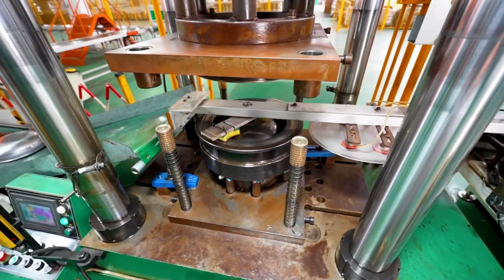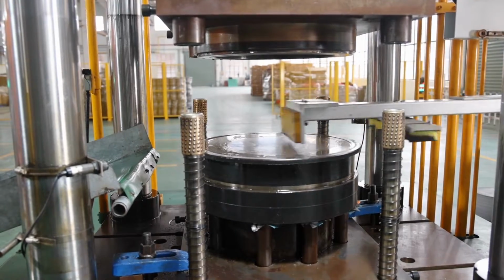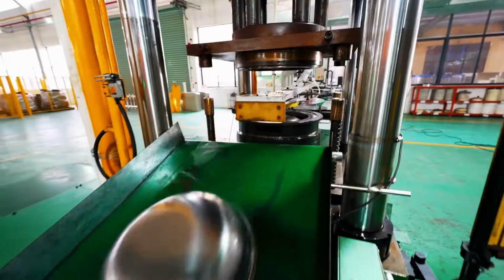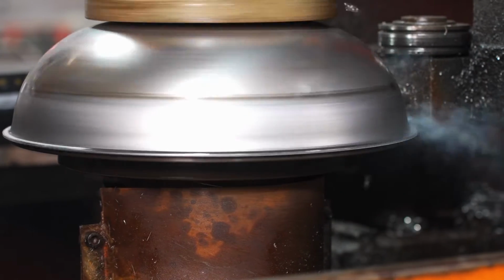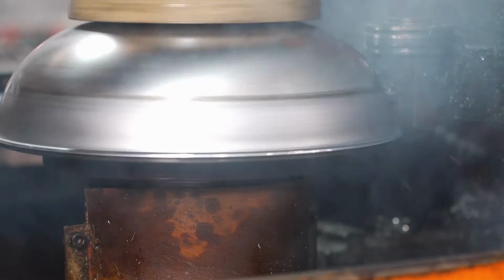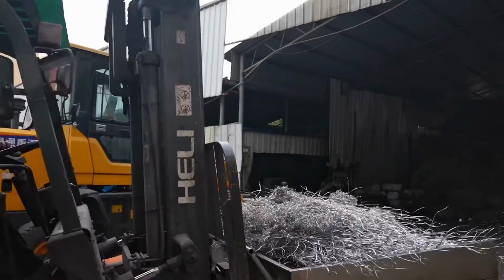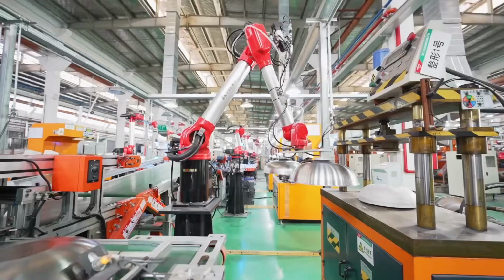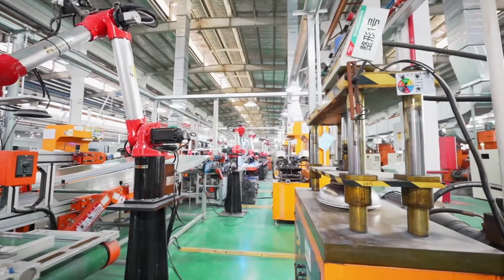Machinery now pulls the aluminum sheet forward to a 130-ton punch press. This powerful press forces the metal around a frying pan-shaped die, and then punches out the shape. The sides of the pan are very uneven now. The machine is now cutting the edge, and the edge of the pan is cut flat. The freshly formed aluminum frying pan falls onto a conveyor below, and the leftover aluminum will be used to make new frying pans. An automated squeegee silk screens the company's name and other information onto the pan bottoms.